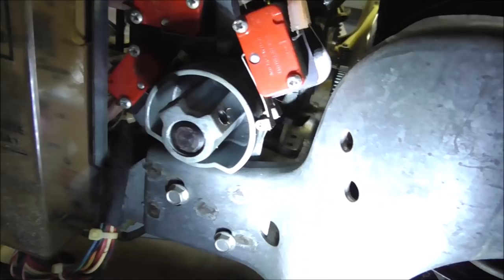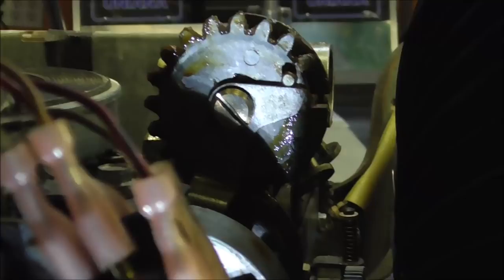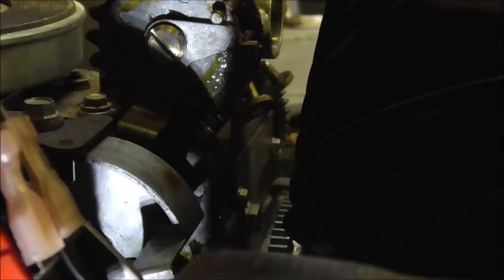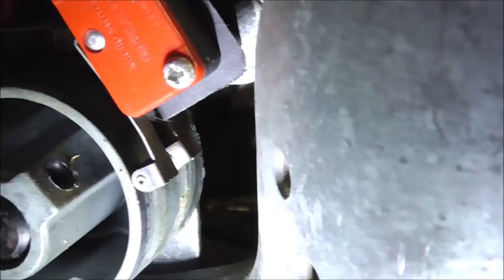But if you look, there are the gears that I was talking about, right? And they're simply held on with grease and a screw. So that screw is holding a little arm on it, which I believe is the part over here that, yeah. Okay, see how that's moving? It's the part over here that the little brush brushes the needle. But anyway, that's on the back. So you have to take that off so that the gears can come off.